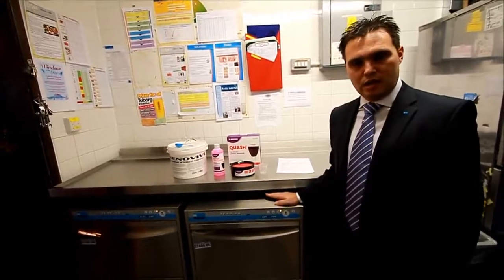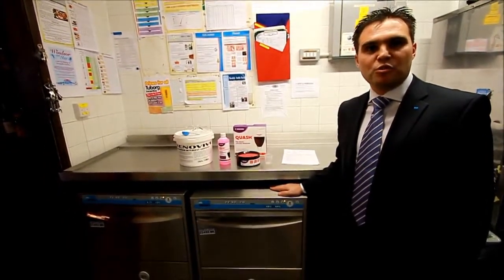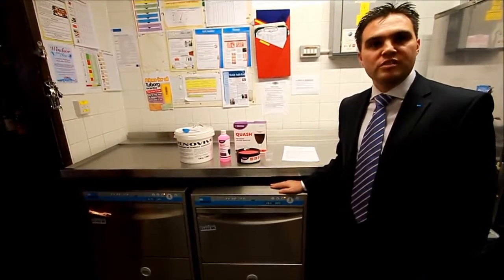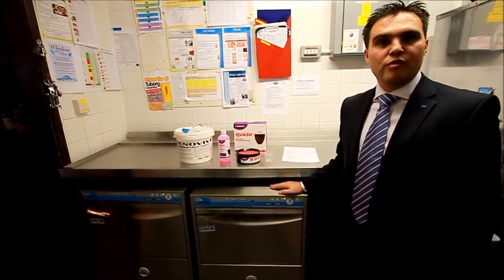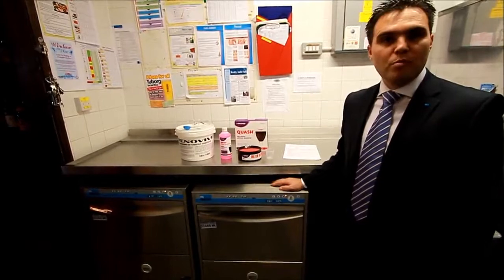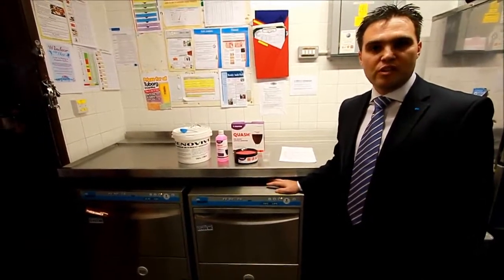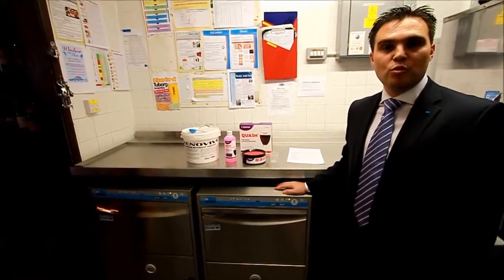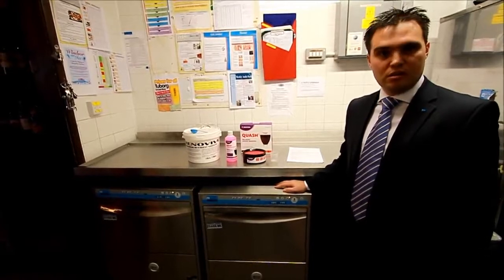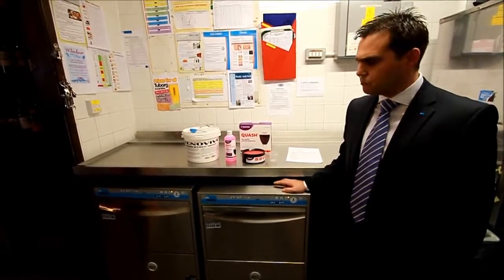Welcome to the introductory video for JD Wetherspoon's new concept of glass washing. It's the mkII 40.2 Geo, which uses new technology of reverse osmosis. The process of the machine is that we're removing all softening. There's no softening that needs to take place with this machine. The reverse osmosis unit provides pure water, it's demineralized water, so it's providing a pure quality water that will give you perfect glass washing results.